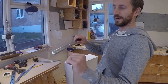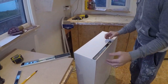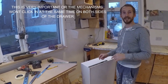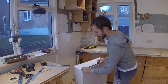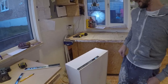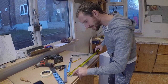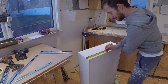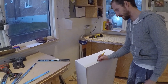We're going to pick up the smaller part of the runner — the part that goes onto the drawer — and mark where to fix it. This part of the runner needs to be completely flush with the front of the drawer. If you're using slow-close or push-release runners, get them exactly the same on both parts, otherwise they won't click in and work properly. We're going for three horizontal holes — one at the front, one in the middle, one at the back. Measuring from the front, the hole centers are at 34mm, 163mm, and 290mm. Mark those on the drawer giving you three crosshairs.